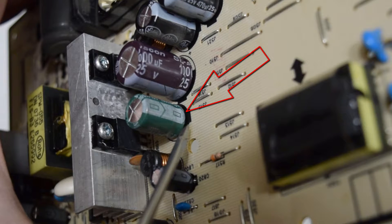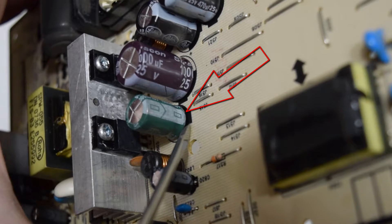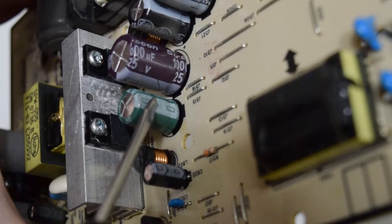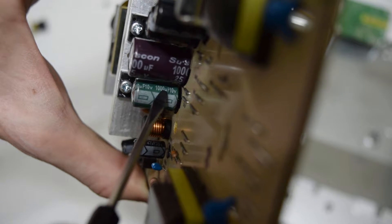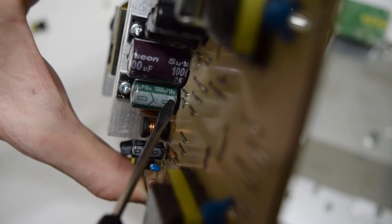This black area is the negative side of the cap. This type of cap has polarity, so make sure that the stripe goes to the black negative side. This cap has a maximum voltage rating of 10V and a nominal capacitance value of 1000μF.